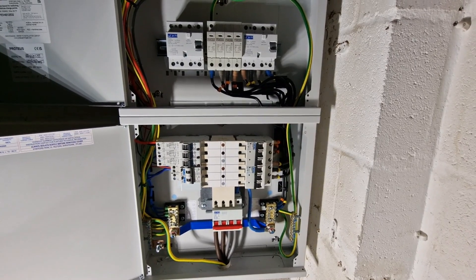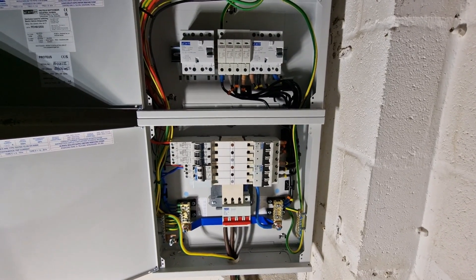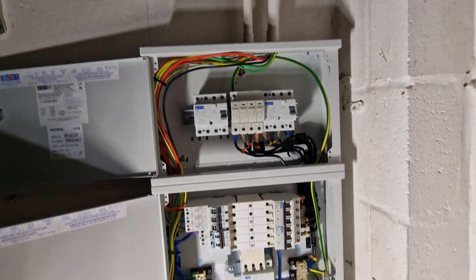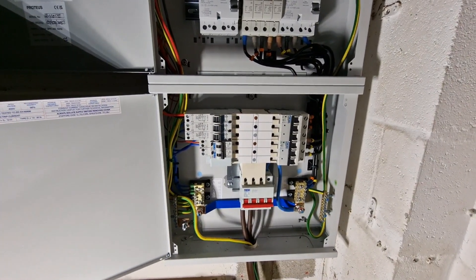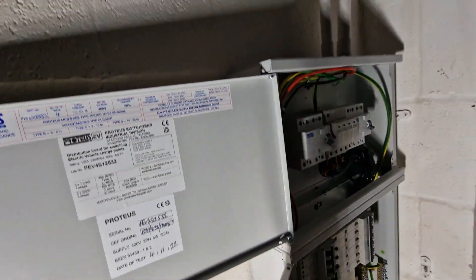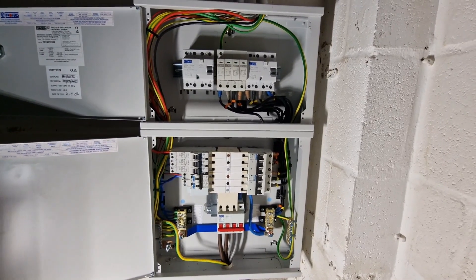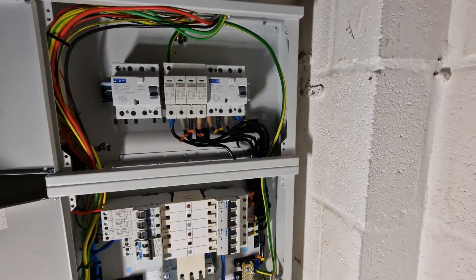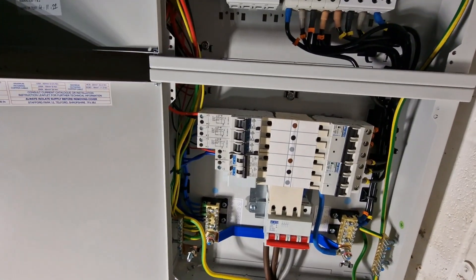I can get some power on in here because I do still have that metered connection and he's given me permission to pop the fuse back. I've popped the lights onto the appropriate phase so I can turn that on. It's a pretty decent board — I'm quite impressed with it. I'm going to get the cover on and we'll see how it all looks buttoned up. It's really easy to work in, loads of entry points and lots of room considering its low profile to the wall — it really is a slimline board. For around 750 quid with the RCBOs and all the pre-wiring, the wires were in there and cable tied up nicely, same with the neutral flyer leads in the back of the board.